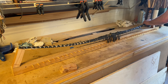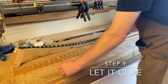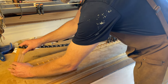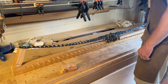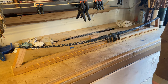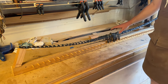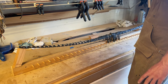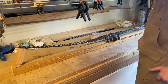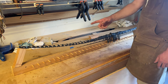Step number nine, the very last step: allow this bow to cure. There are a couple of different methods. One is a hot box - if you're lucky enough to have one, you can set it in there at about 165 to 185 degrees and it will cure out in about six hours. If you're like me and don't have a hot box, you allow this thing to cure out for 24 hours and that'll cure the epoxy. You should not in any instance begin tillering this bow without allowing it a full cure of about 24 hours. Some guys suggest going 48 hours - either way, you do what you believe is going to be best for you. I've always gone 24 and have never had any issues with delaminations on this type of glue up.